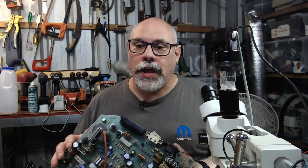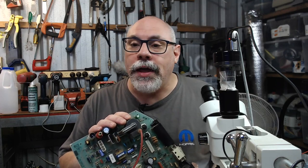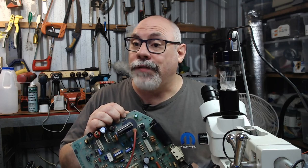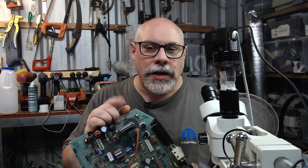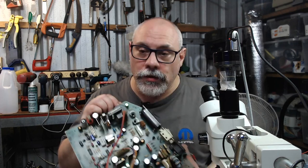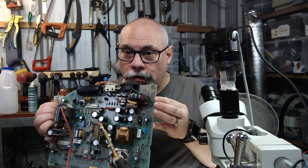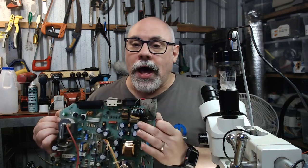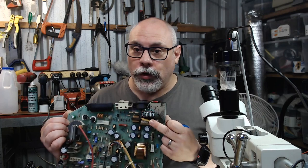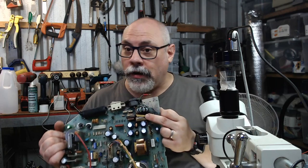They're essentially like filters. They smooth out spikes if you're connecting this to mains power, and they're specifically designed to fail if there is a large enough spike. Fail being an interesting word in this instance, because they do actually recover. What they do is they fail closed. What that means is they send that spike into the board and then should theoretically make the fuse pop. So this is why I expect this fuse will probably be gone in this as well. We'll probably have to replace that. But they are generally self-healing as well. So once they do spike and make the fuse pop, they should still be able to work. But these old RIFA paper capacitors have a limited lifespan, and they've reached the end of that lifespan, and that's why they're all popping.